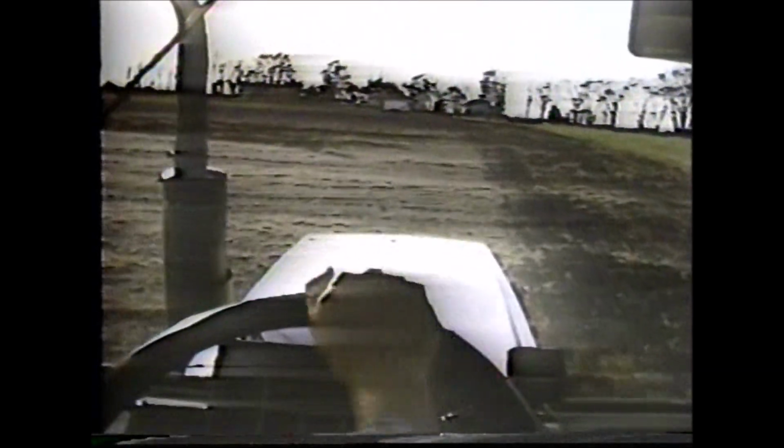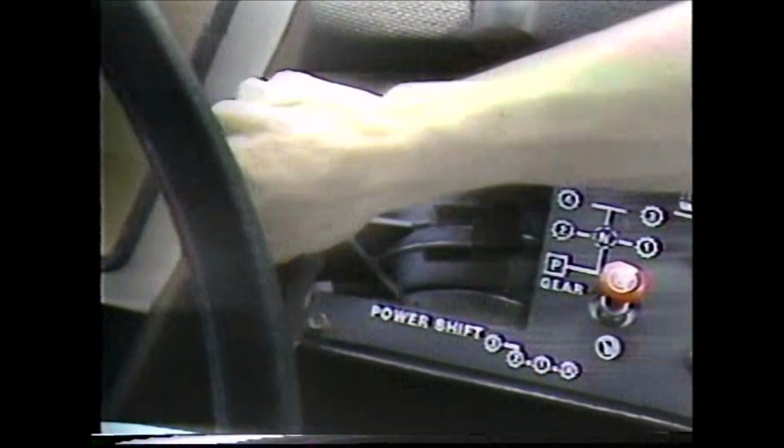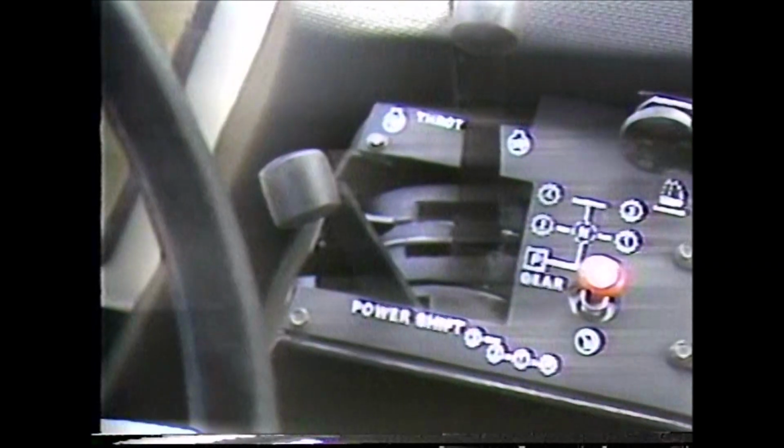Certainly, there's a lot of convenience and efficiency in being able to use the inching pedal to downshift at the end of the field, especially when you're trying to turn and operate 2 or 3 remote levers at the same time. On the other hand, when you're in the middle of the field and have a free hand, it makes sense to downshift with the lever and spread your clutch life out. Can you see why we say it's up to the customer?